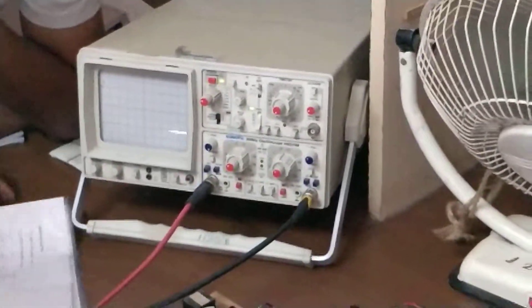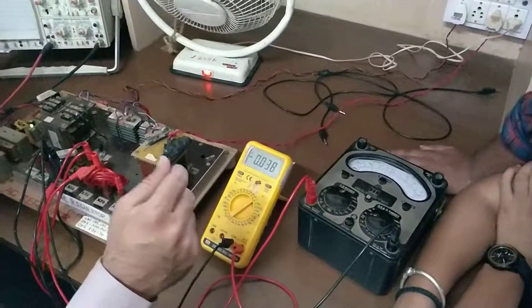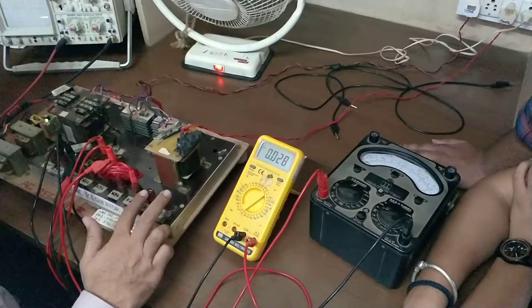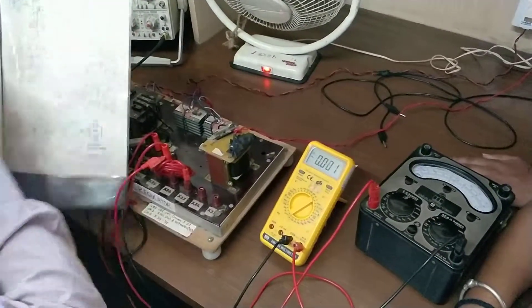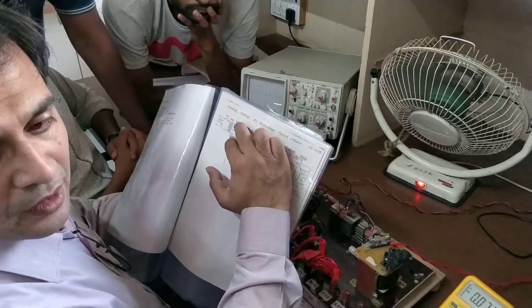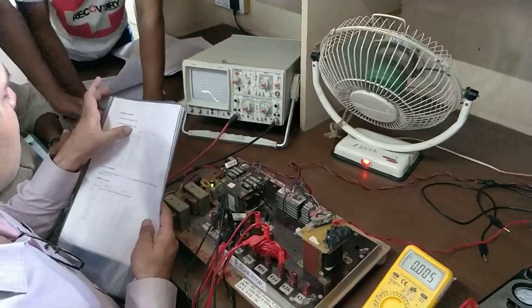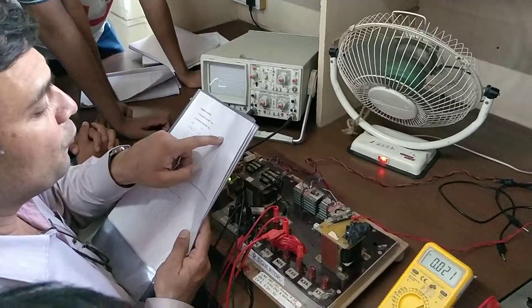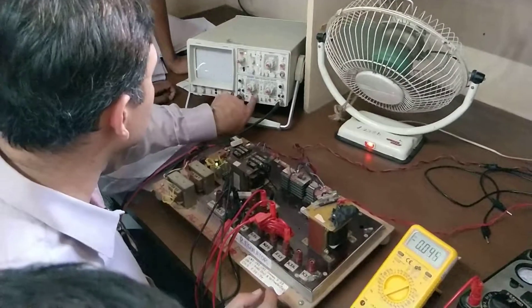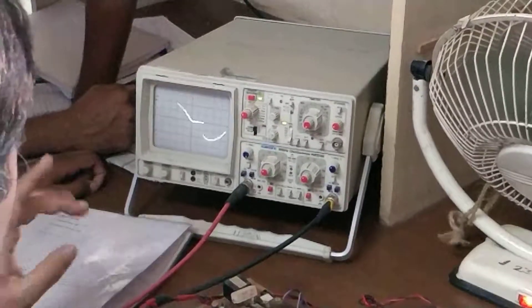So let's go through a reading. First you have to measure Vs, the supply voltage, after completion of all readings. Remove the multimeter and connect between pins 31-32 — that is the input to the bridge. So that will be Vs. Now, multiply Vs into root 2 minus 1 Vt (which we just saw). That will give Vomax. That should match with Channel 1 when alpha is less than 90 degrees, at the peak.